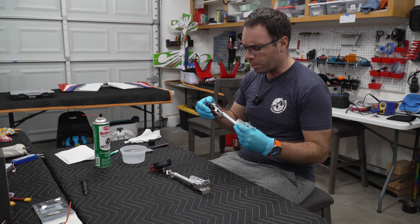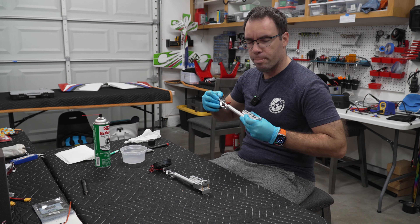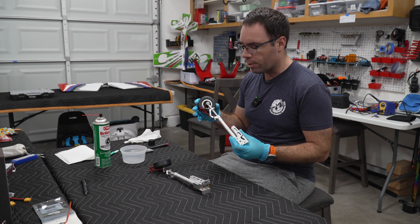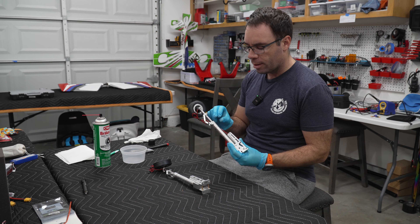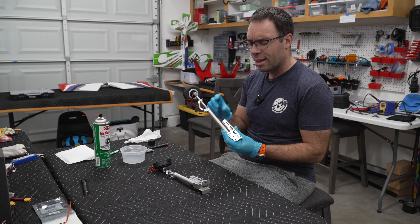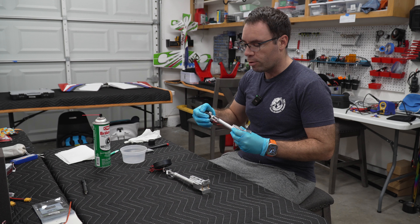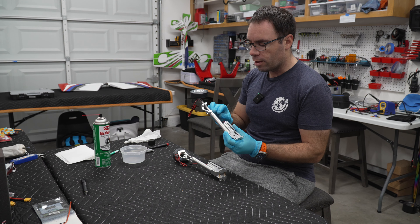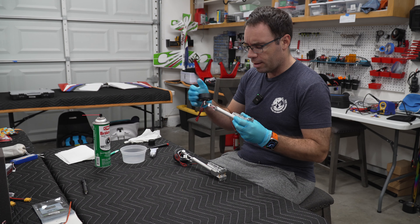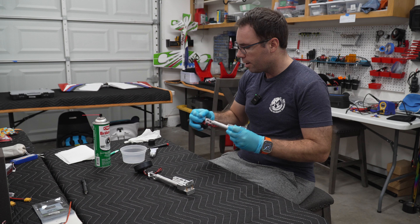The suspension on this gear is very stiff. The plane isn't that heavy, but you have to apply a lot of pressure to compress the suspension. We're going to remove some of the grease inside — there's a spring with thick, sticky grease applied for lubrication, which makes the suspension harder than we'd like. The one we've already done — cleaned and regreased with lighter grease — feels much softer compared to the factory setup, so we'll do the same procedure on the other one.